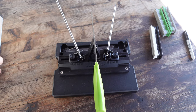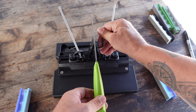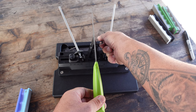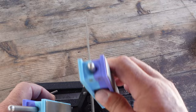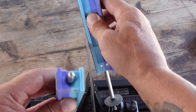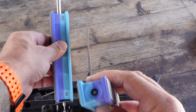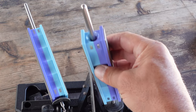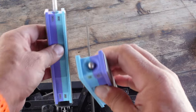Now switching from 600 to the 800 grit. Before swapping the stones, I double-check the vise to make sure everything is tight — it can get a little loose with the rougher grit stones, especially when working hard to create the burr. Don't over-tighten it, but make sure the knife isn't going anywhere. With the 800 grit, same process as before — either in thirds or one longer stroke, whatever works best for you. 20 passes should definitely be enough. The burr is created and everything is getting much smoother. If a certain part needs a little more work, focus on that section and do the same on the other side, keeping everything even.